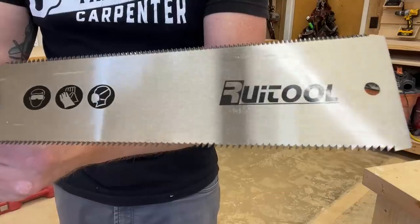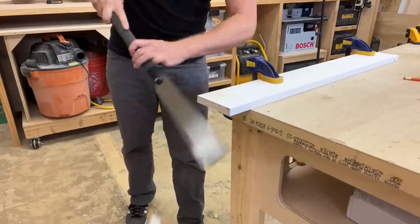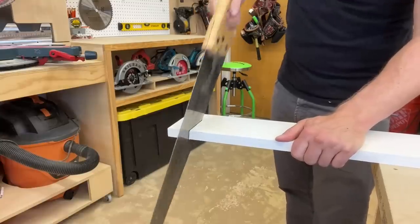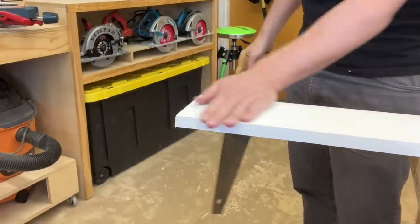Overall, I do use both of them. I've really come to rely on Japanese saws in fine finish situations because cutting on the pull gives you tons of control, and it's nice to have both tooth patterns available. But if I'm looking to do a lot of fast, heavy cutting and finish quality isn't quite as important, I'll often prefer a western saw. That D-grip and the forward stroke really let you drive with power and you'll get through material fast — they're extremely helpful in situations where you just don't have a power saw nearby.